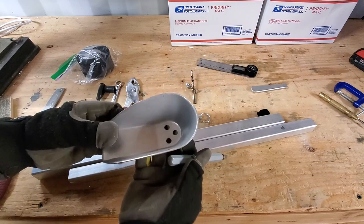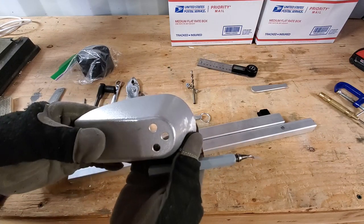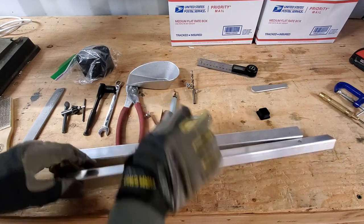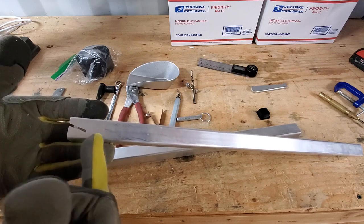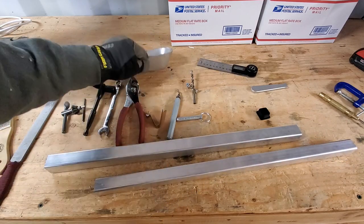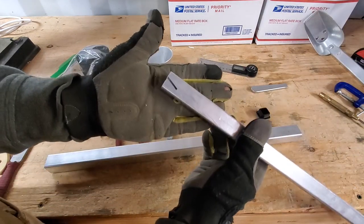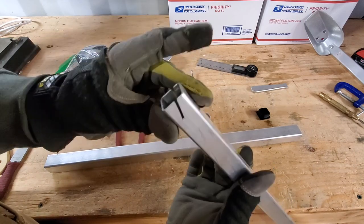At this point your scoop should have three holes drilled in the bottom, the handle cut off and filed smooth. Run a deburring tool around all holes to remove aluminum burrs. A quick note about the slit: it's about an eighth of an inch in thickness going in three-quarters of an inch at a 70-degree angle. On my first prototype I over-cut it a little bit. You can cut this slit with a Dremel, angle grinder, or similar tool.